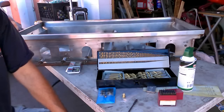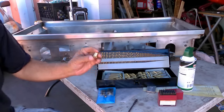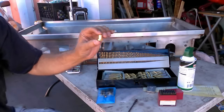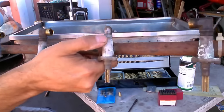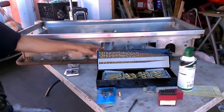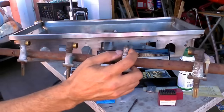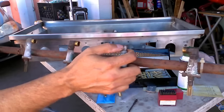There are a couple things that have to be changed, but what I'm going to focus on in this video is the actual orifices. Orifices can be a number of different shapes — these are hooded orifices — and there are a number of different styles. The orifices fit on the burner tube. I removed this here just so it's easy to show. This has to be taken off and a new one put on. The orifice fits up in here and shoots the gas into the burner tube, and then the burner tube will ignite.